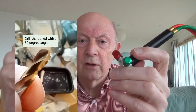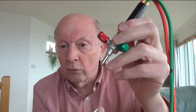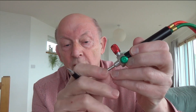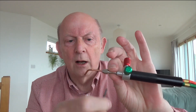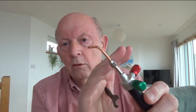What I did: with a drill, I drilled a countersunk edge to give a chamfered shoulder in that tube, so that it better suits the angle of the olive. The drill I had was missharpened at 50 degrees, a much sharper angle than normal, but in my case that actually helped. I drilled that little face very gently, holding the body of the torch upside down so that drill shavings wouldn't fall down and get into any small orifices. Now I've got a nice face that gives a good seat onto the olive on the nozzle. When you tighten it up, hold the tube with a pair of grips, do the nut up, give it a bit of a squeeze to seat the olive, and you'll have no more trouble.